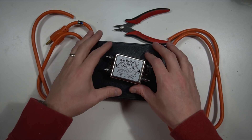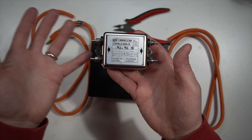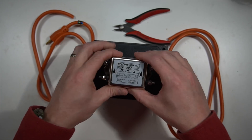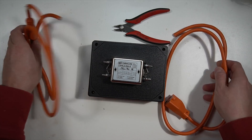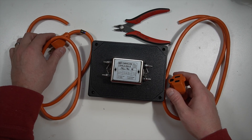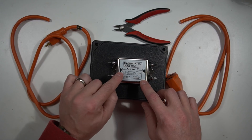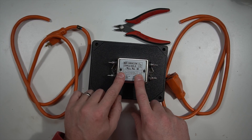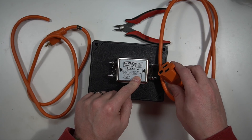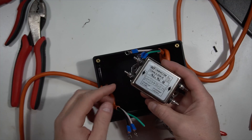So the last step in this journey to get the dryer into noise compliance is to add this AC line filter that's going to live in this project box. I've gone ahead and cut two leads of an extension cord so that we can carry that ground over from the line side — the line side being the wall and the load being the appliance. Let's fab this up and see if it works.